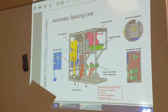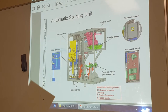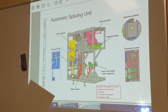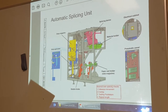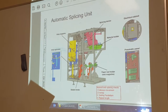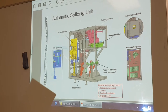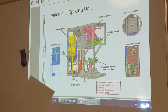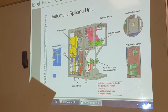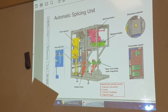The thing with the transducer that this sits on: if this fails, you have to put it into the correct position. I'll show you down on the machine. On the back of this transducer there is a line engraved on it, and it must sit at a certain position to the clamp. And this is 10 mil. I'll show you on the machine where this is. This is the only setup you have to do if you replace the transducer.